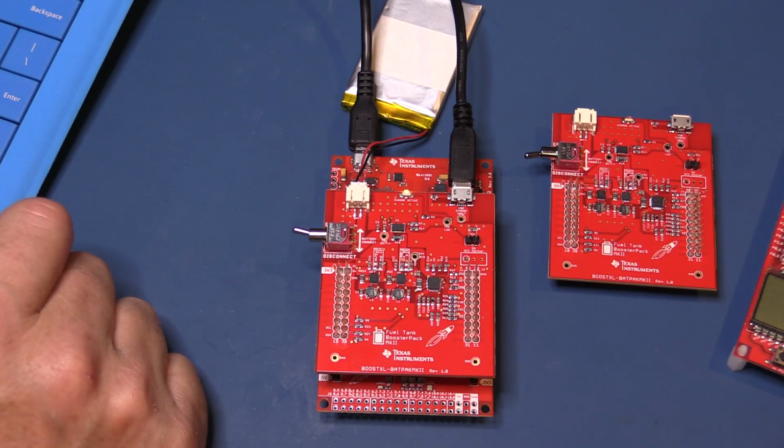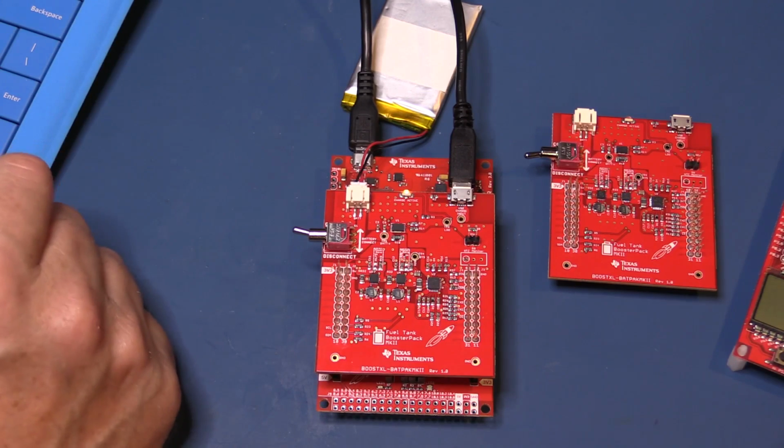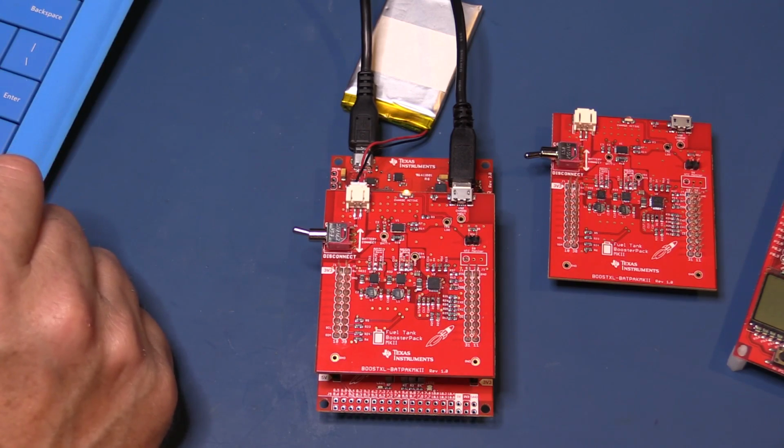because these will only give out about 800 milliamps on the 3.3 and 5 volt rails, and that's not enough for a Raspberry Pi, but certainly for Arduinos and other small circuits that you may want to build, this is more than adequate to provide a sort of battery backup. Or if you were going to use an ESP8266 or something like that, it would certainly work for that. For the launch pads, obviously you can see right here that it's been working quite happily, slowly charging up.